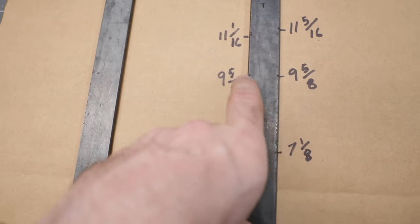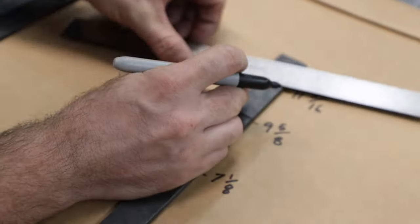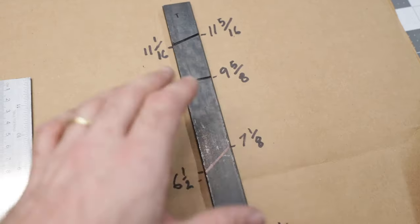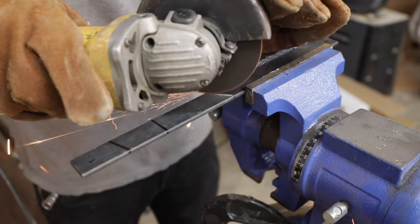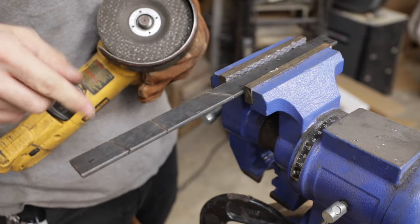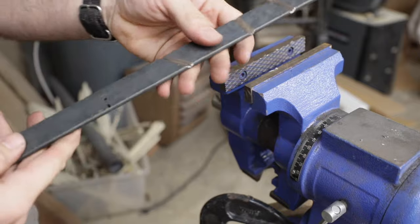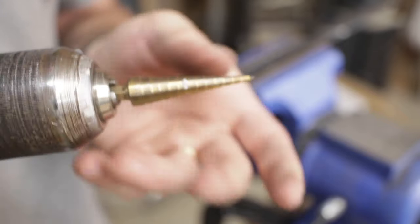Now I'm going to connect these dots and then make some cuts so we can bend this to the shape we need. I'm using the angle grinder — I'm not cutting all the way through, just cutting a groove on each mark so we'll be able to bend it to the shape we need before we weld it all up. Then I'm switching to a grinding wheel to make these grooves wider. Now I'm going to drill out the holes for the mounting locations using a step bit — I'll probably go up to almost half an inch, seven sixteenths or so.